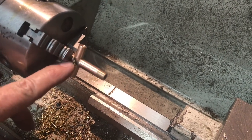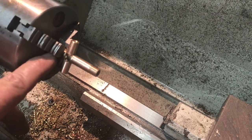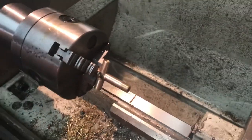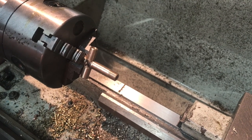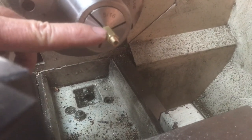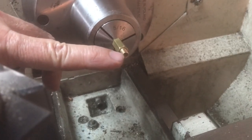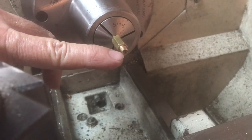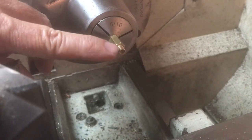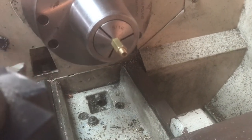Not much to it — clean face, turn the outside diameter, and drill a 1/16th inch hole up into the passageway, and then drill and tap a little portion that the fitting can get fastened into. Here is the oil fitting. It's made out of 5/16ths inch hex brass. I've just turned down a 1/4 inch portion here to 218 thou. I just threaded it 7/32nd 40. I deeply center drilled it because that's where the little oil fitting will be on the bottom, and I used a number 43 drill to drill through. Now I'll cut it off so I can reverse it and do the other side.